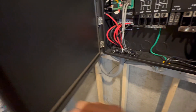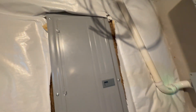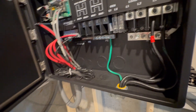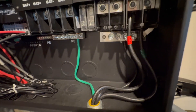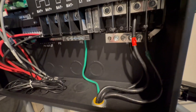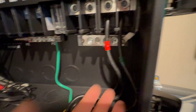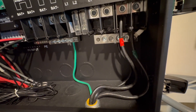These network cables are what connect the inverters in parallel. The way the inverter knows how much power the house is using — so it knows how much to supply — is through a CAT5 cable going to my breaker panel, where there's a CT clamp on both of my hot lines, Line 1 and Line 2. It has to be there monitoring total house power, not at the inverter output, because putting it there would confuse the system.